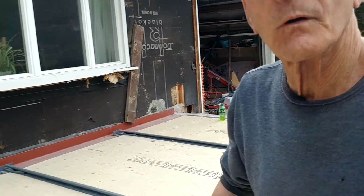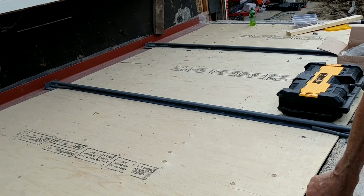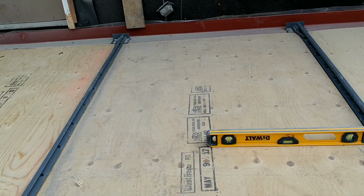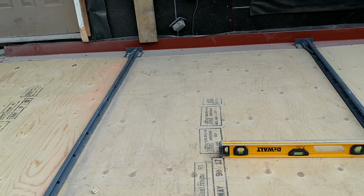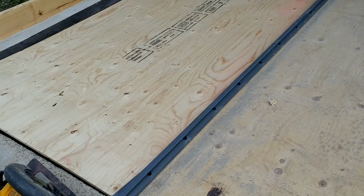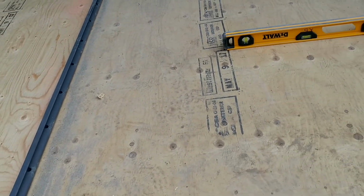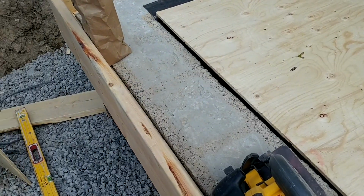Fiberglass. You can put the, you know, order. That's supposed to be taken away. I could do Euclid, but that would require time. I did want to try out Euclid, but I don't have time before Saturday to get that. Have you ever done Euclid? Those look like nails inside the concrete. It's like fiberglass reinforced. They make a fiberglass one and a metal one, and the one most people use is the metal one. It looks just like a spiral nail. It's about this long and they chuck it inside the concrete, either in the truck or in the factory, and it basically replaces 10M bar at 16 inches on center. I'm being serious.